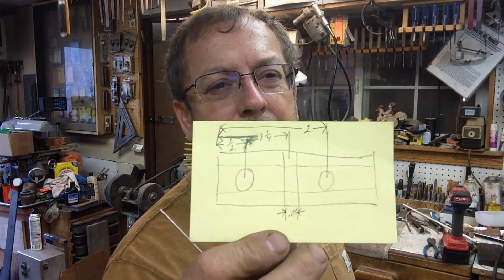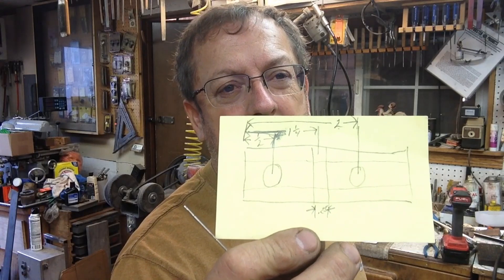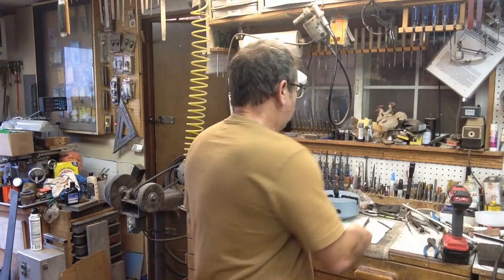We're trying to finish up soft jaws today, or at least the first set of soft jaws for this little chuck. Here's my chicken scratch drawing — that's pretty much all the dimensions I need other than the width for the channel in the center. We're setting them up using just standard cold roll stock for this first setup, which is all that's necessary. These are short production runs and this is material I had laying around — half by one flat stock, cold roll steel.